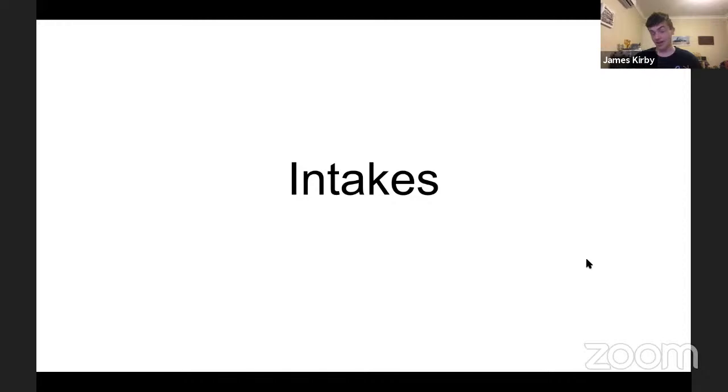I have seen for the case of FTC, pretty much that specific linear actuator had a Neverest motor sort of hacked into it by the Blacktown Girls robotics team. They had a chain sprocket driving from the motor to the screw of the linear actuator. And from my understanding, that hoisted their robot just fine. So for FRC purposes, if you can't make one from scratch or get the Dart actuator, which is an off-the-shelf SIM actuator, a 775 class or 550 class motor will probably be ideal for those.